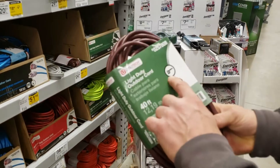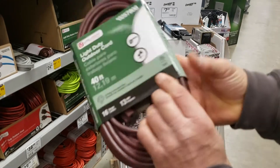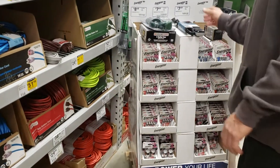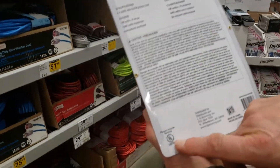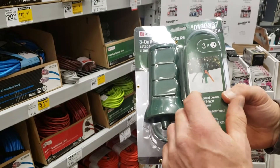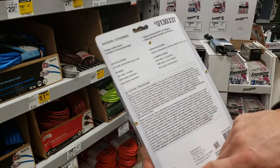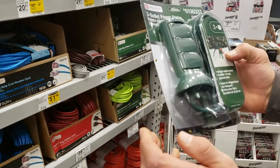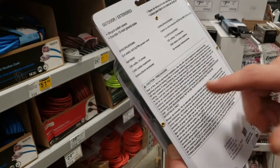There's another light duty outdoor cord that's good for a blower or a spotlight — it's 16 gauge, 13 amps, but it's definitely rated for outdoors. Somebody asked me about Christmas light extension cords. Whenever I'm in doubt, I always look on the back to see if it's UL listed and has been tested. This one is for light duty use like Christmas tree lights — it's 125 volts, 10 amps, and 16 gauge. Make sure it's UL listed.